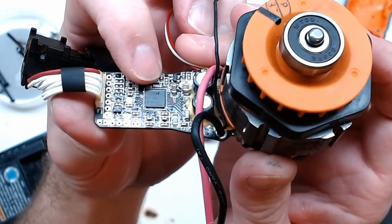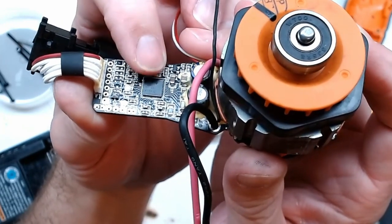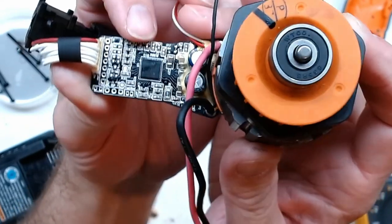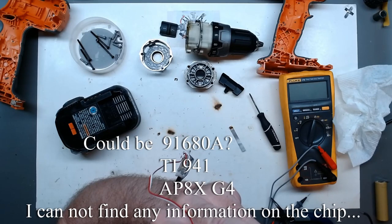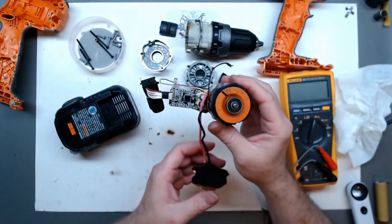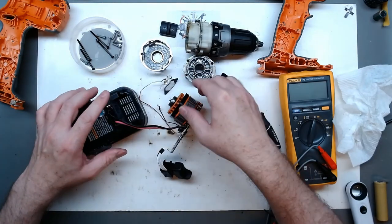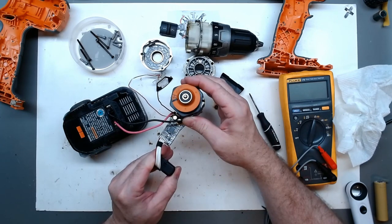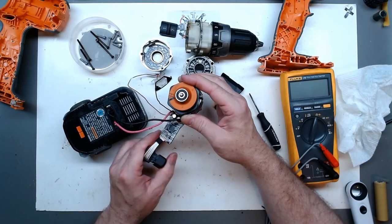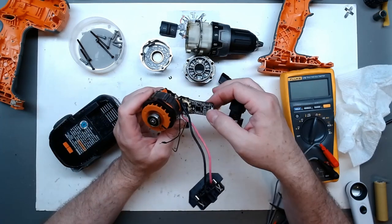One thing I did not notice earlier — and may not have been there — is that little spot on that microcontroller. That looks like a hole that's come out, almost right there where the zero would be. It's a Texas Instruments 91680. And that's actually not another zero — that's a spot that has come through. It may have gotten worse the more I was troubleshooting it. So for me on this repair, I probably won't go any further since it got the microcontroller.